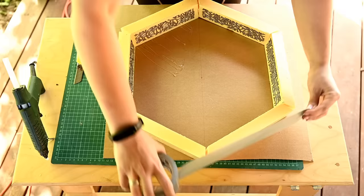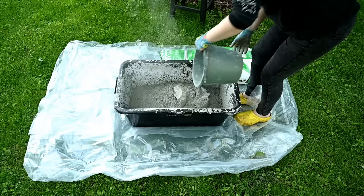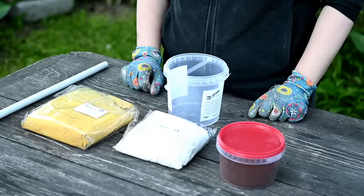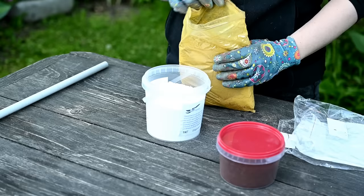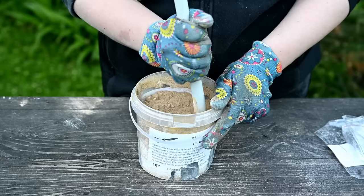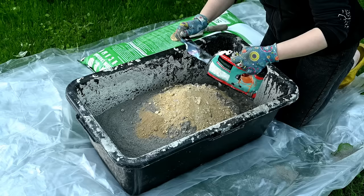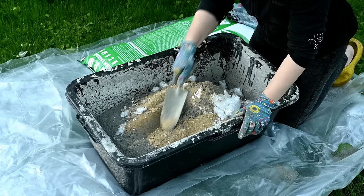The lantern molds are ready. Next I'll prepare the mixture to fill the molds. I've already shown this process in my videos about hypertufa pots and stepping stones and here it's pretty much the same. When I was making the stones I added brown concrete dye to the mixture and I didn't like the result. This time I decided to try adding white, yellow, and brown to the mixture so that the lantern would be something beige, close to the color of natural stone. I made a mixture of the three colors until I got a more or less desired shade and I'm adding this mixture to the cement, along with a general handful of concrete fibers as usual. After that I'm mixing the cement properly.